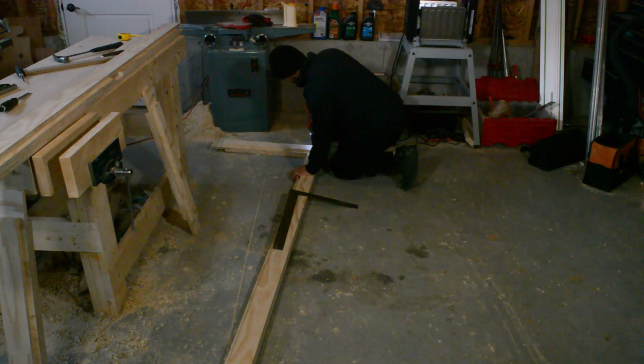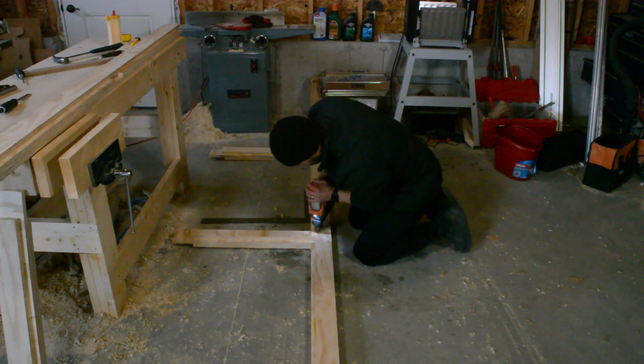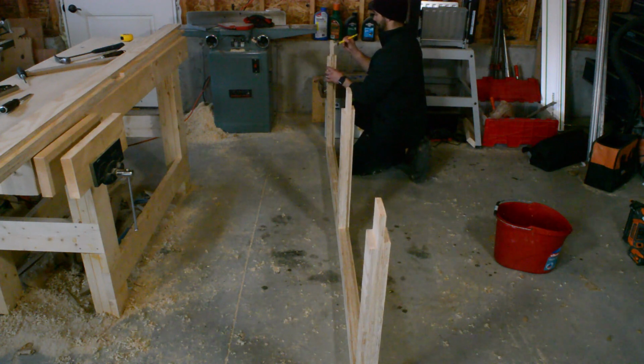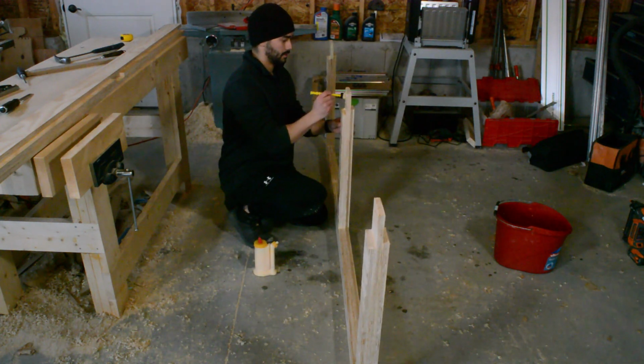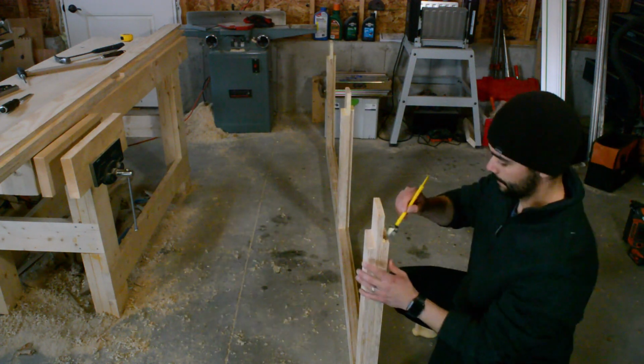Once I'm satisfied with the components, I'll move on to assembly. The shorter pieces slot into the longer pieces that form a big tongue and groove, and the shorter middle piece slides in to form a mortise and tenon. All of the joints get brad nailed into position, which everything gets put into clamps and squared up.